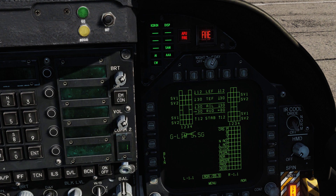'AAA' — anti-aircraft artillery: the fire control radar is locked onto the aircraft. It's a steady light for all radar-directed triple-A except the ZSU-23-4, for which the light will flash when you've been tracked or fired on. We also have the APU fire system — if that light illuminates, the APU has caught fire; push the button to engage the fire extinguisher. Similarly, the right engine fire warning and extinguisher light: if it illuminates, your right engine is on fire — push the button to engage the suppression system.